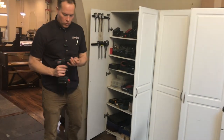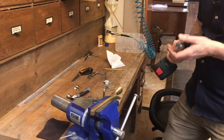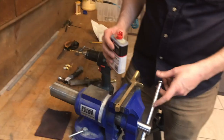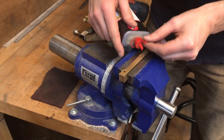When drilling wood, you want to go fast. And when drilling metal, you want to go slow. It probably can't hurt. We'd probably be okay in this instance without lubrication, but when drilling through metal it's not a bad idea to use just a little bit of lubrication.